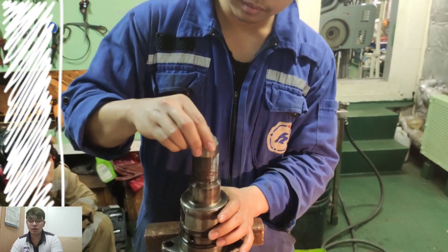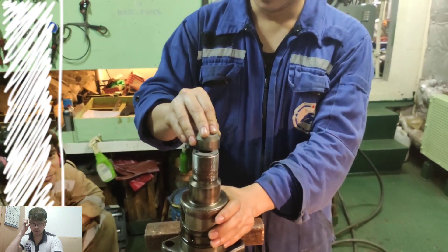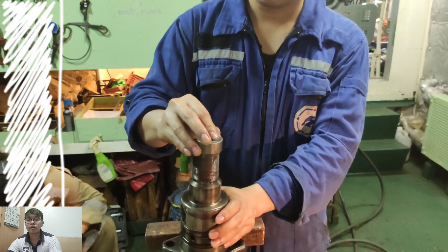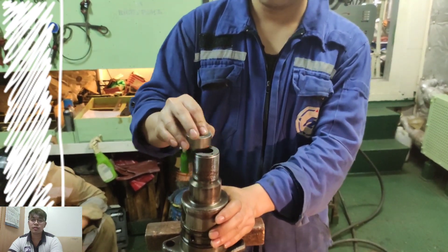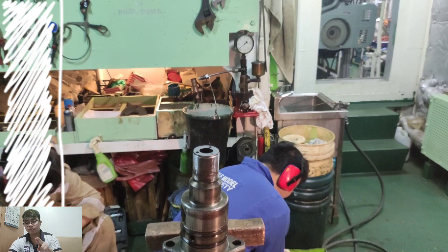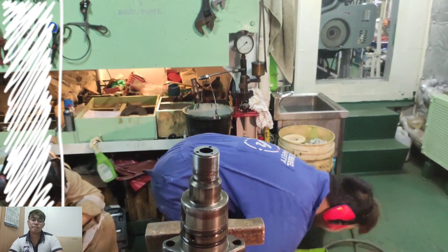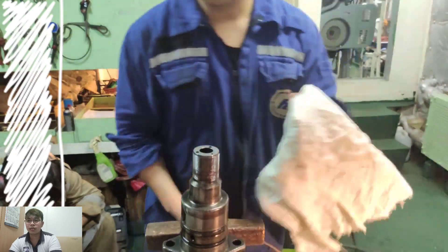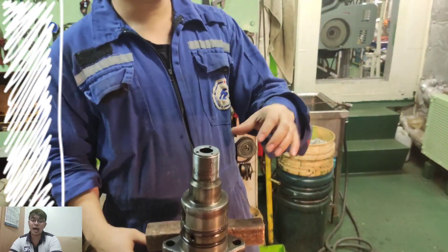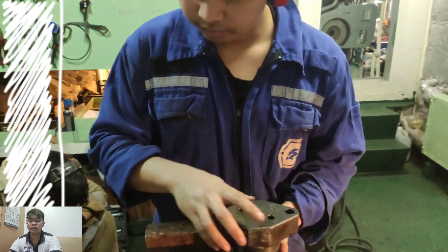This is the piece where we have to clean all the parts of the fuel injection valve. I am lapping the spacer and the seat by using the grinding compound. The way I do it is I use a figure-8 motion, because using the figure-8 motion can grind equally all the parts of the seat and spacer. After that, we have to clean it with a cleansing oil and then blow some air to it.